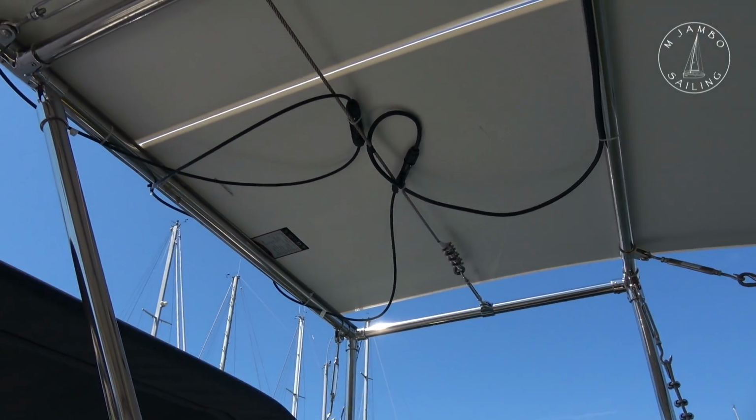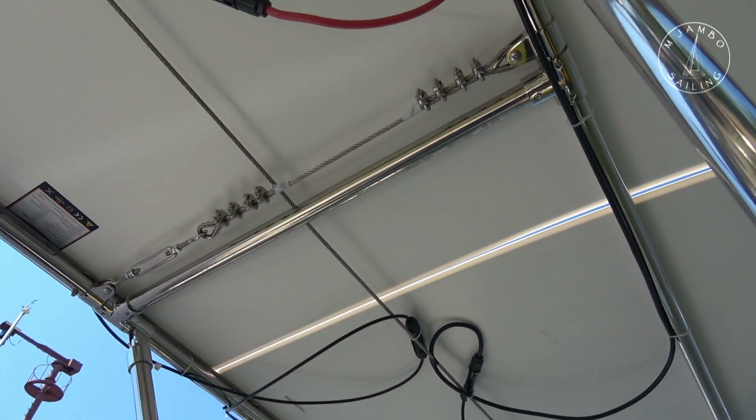Then I put the solar panels on, 4 units with 120 watt peak, which means the total installed power is 480 watts. That's a theoretical number, so we need to see what's coming out, but I'm quite pleased with the first results. Then I bought all the cables, the cable connectors, and the charge controller, I think is the right word here. And I will show you that as well.